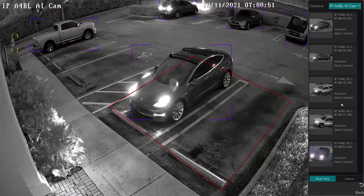I want to mention a couple of things before we wrap up. That's a 4K resolution IP camera that has built-in AI software. Although I didn't demonstrate the AI software in this video — like the people object detection or the car object detection — I have plenty of other videos on our website that show that. That's a motorized zoom lens camera, so I had it set at the widest angle to get my entire driveway, but you could zoom that lens in anywhere between a 2.8 millimeter and 12 millimeter setting. The infrared night vision on that is really strong — my driveway is partially lit, so as you saw, it even turned color part of the time because of the ambient light in the area.